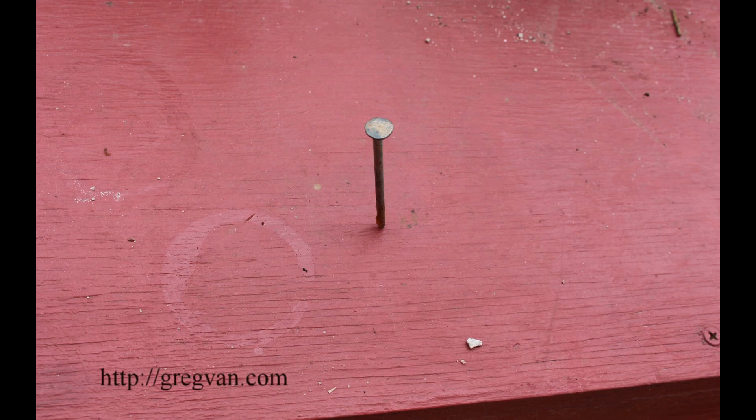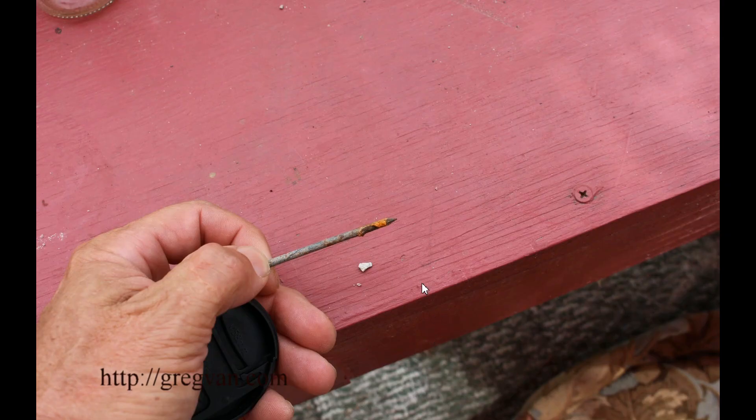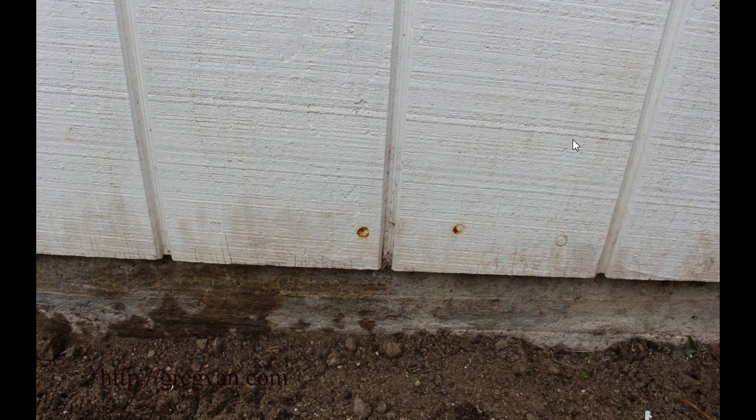I'm not saying that you are going to have problems, but you need to keep that in mind. Right here, I would imagine — if I had to guess — this is where the coating either wore off or wasn't very thick, and this is of course where it rusted the most. Remember the nail was completely submerged — it wasn't like only part of it was in the ground. The main point I'm making in this video, and I've been telling people this for years, is about coated nails.